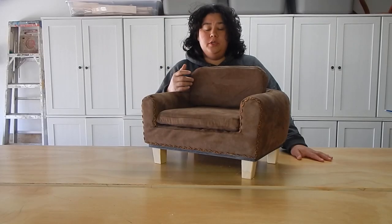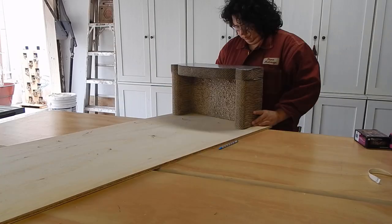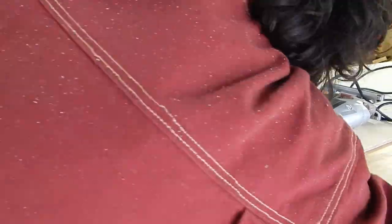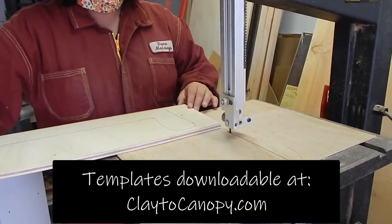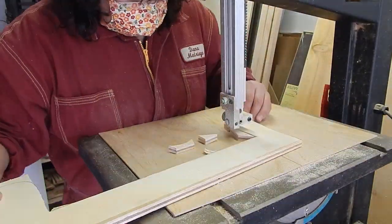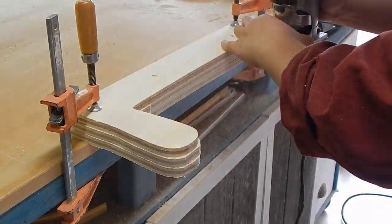The first thing I did was to trace the original cat scratcher that I had, which was actually a cardboard cat scratcher, and I used it as a template to make this piece. Using my template I went ahead and cut four of the front profile and one of the back profiles. To be sure that I had nice and even pieces I cut out one form, sanded it down to make sure it was nice and smooth, and then used that one form as a template.